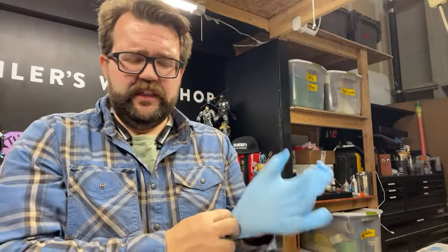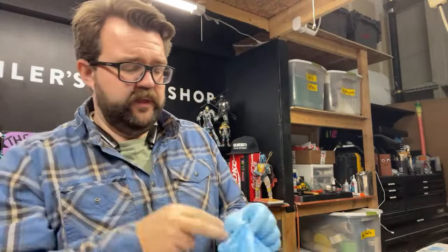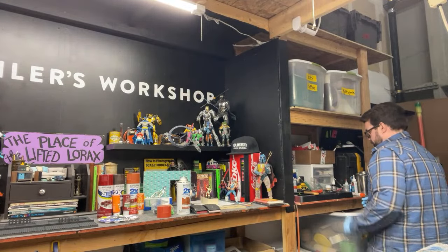If it was a larger piece, I would just brush on the stain, but because I think this will fit in the can, I'm gonna dip it into the can and pull it out probably a couple times and just let it drain. I might wipe it, depending on how heavy the stain sits on it. So I'm gonna grab my microfiber cloth for wiping, and I'm gonna use a piece of wire here. It's just some baling wire I had lying around, to dip it into the stain. Visual ASMR for the stream. What was I just about to grab? Oh yeah, flathead screwdriver for the can. Let me flip this around.